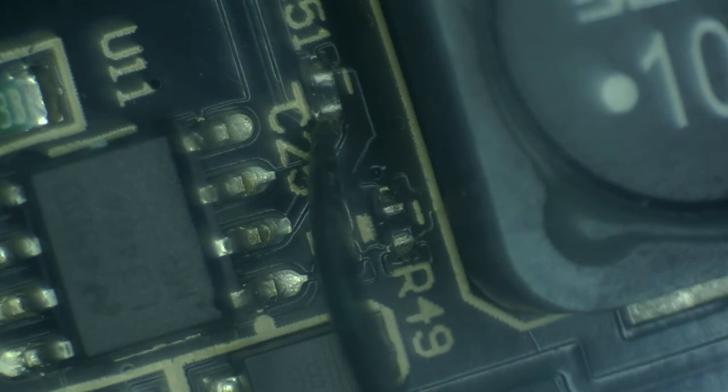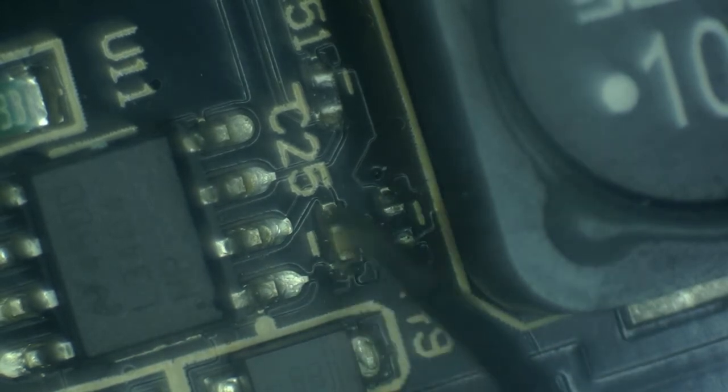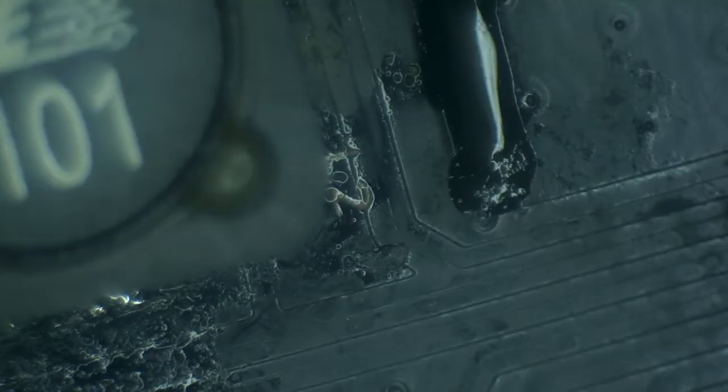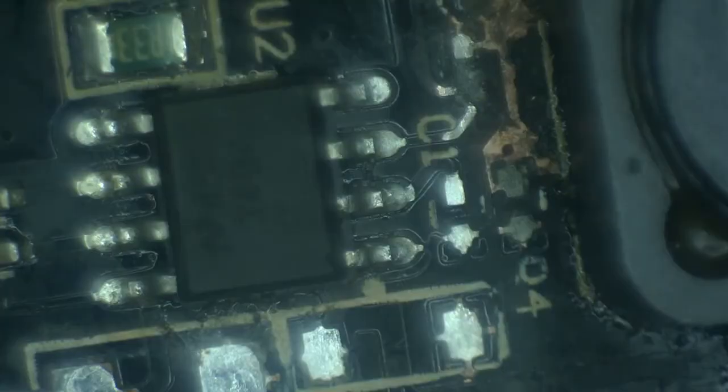So this doesn't look like a via at all. So that's just the pad that got burned off. There's a resistor here, for which we already have a pad, and there is a capacitor here. Okay. So all we have to do is just repair those two areas, put new components in here, and this side is going to be mostly good. Now let's flip it over and look at the burned edges. So this is the really badly burned edge.